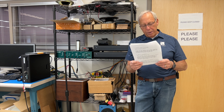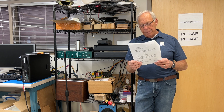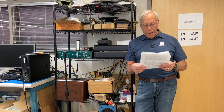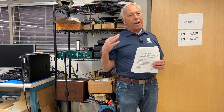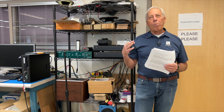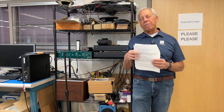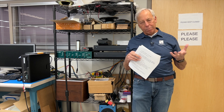We could, for example, mount them in a do-it-yourself box with good connectors. Would they work in the first place? Actually, we talk a lot about conversion from XLR to RCA, and I wanted to make the point that I've tried several times — it's not a great idea to do it with a passive adapter of the kind that you normally see for ten bucks or something.